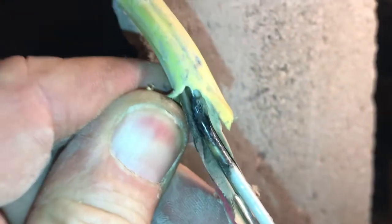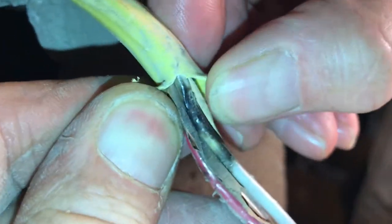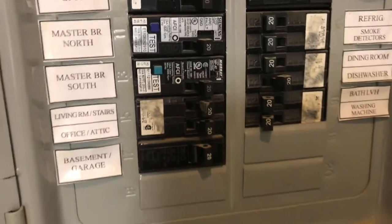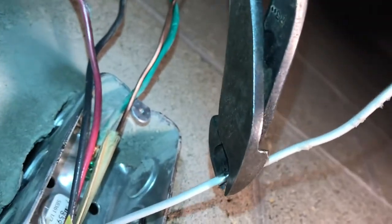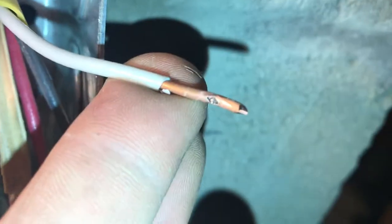You can see that the white neutral wire is completely blackened. When I spread these wires apart, you can really see that the neutral wire insulation was broken and it was arcing. So the breaker box was doing exactly what it was designed to do. Because the light switch was grounded to the metal box, the breaker blew. So if I cut this wire apart and strip it, you can actually see the pock marks in the copper.